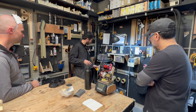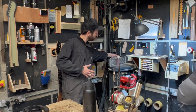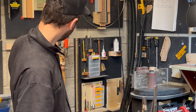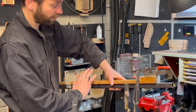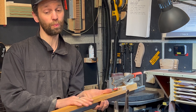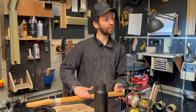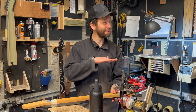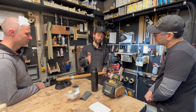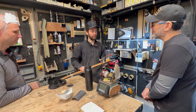This is something we've worked on for quite a while. You can adjust the thickness to take it to the headstock. We have all kinds of jigs we've made — this one here, you can lock down a neck so you can move it around while you're sanding it and tilt it. We use this for gluing as well. When we glue a fretboard, you make the whole fretboard with the frets in it, then get the neck together and glue it flat. The end result is a laminated flat fretboard with the frets on. If you put in frets afterwards, it bends the neck and gets it a slightly funny shape. Our necks are super flat.